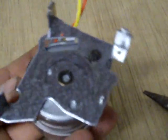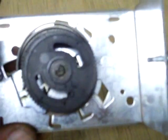Very seldom does the motor go bad — it's always the teeth. So here's what we're left with. There's a spring — you can see the shiny part right here, that's a spring in that hole. And if we pull this wheel off and turn it 180 degrees, it'll go in that hole. Hopefully we won't have the bad section of teeth mated with the drive wheel, which is right there. It's dirty and greasy.